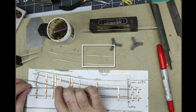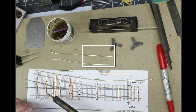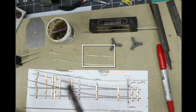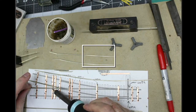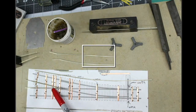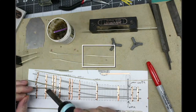But I line up that first one and I get it right over their template. And I'm just going to tack it in place with one solder. And hopefully my iron is still hot here. And I'm actually going to put some solder on my iron. There, now I tacked it in and it's going to stay so I can go along to the other points